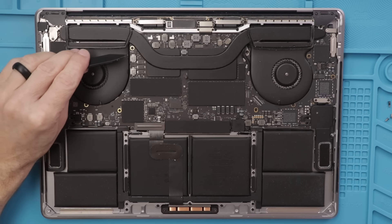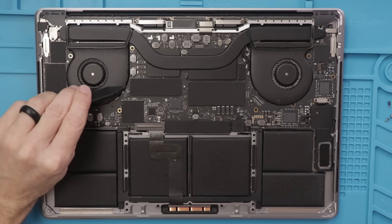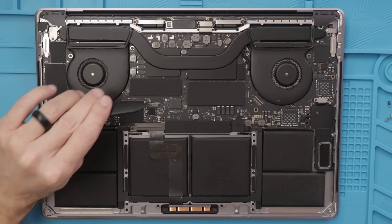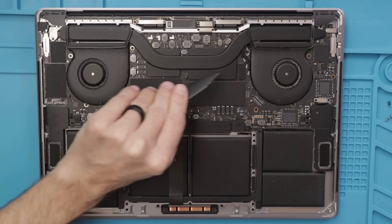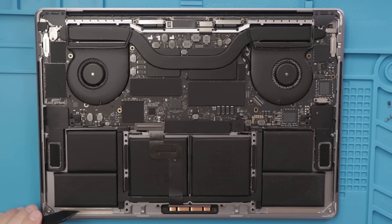As I look at it a little bit more, I'm seeing a little more liquid damage — a little more here, some right here, and some over here. I may have to remove some of these covers to see if there's any liquid damage under any of these chips as well. I still do need to get this motherboard out. I've never taken a motherboard out and never seen it done, so I know basically nothing about it. If I need help, I'll go to iFixit.com and check out one of their guides.